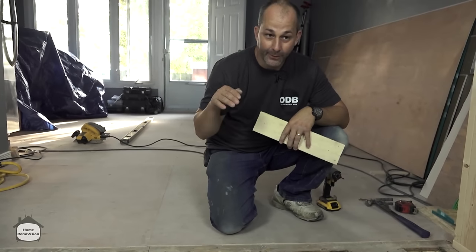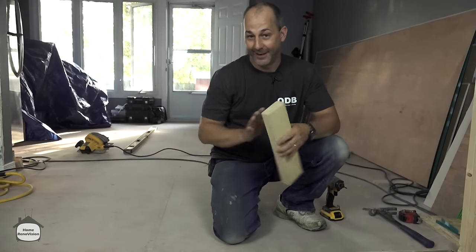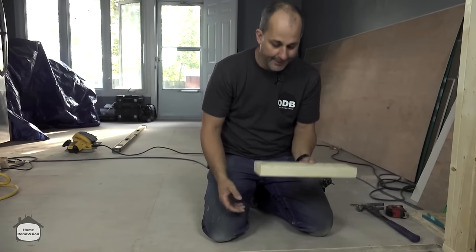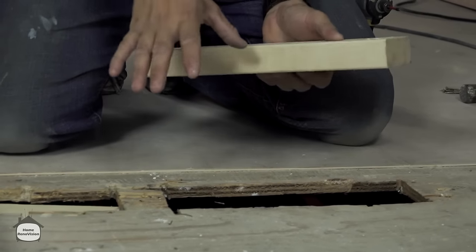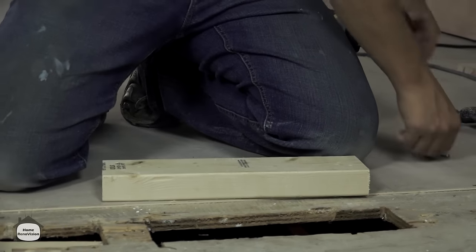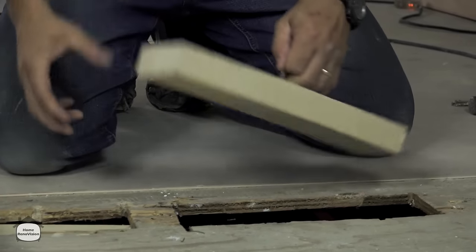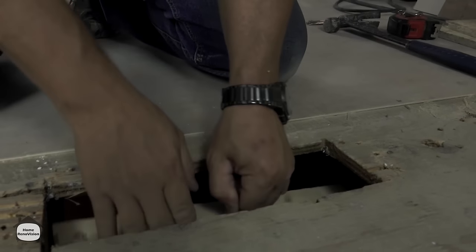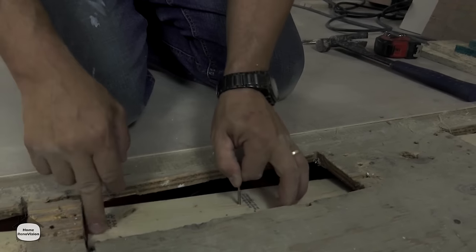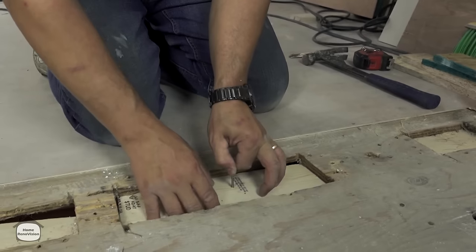Vinyl has a tendency to over time fill in all the dents and divots in the flooring, so we can't just run a new floor over top and say it's good enough - we've got to make sure it's going to last a long time. I've pre-cut my block to the size between the joists underneath. Now if you don't have access to the ceiling underneath, you have to work from above. First you need something to hold on to this wood, so we're going to put in a screw so I can hold on to this wood and wiggle it in here and bring it up.